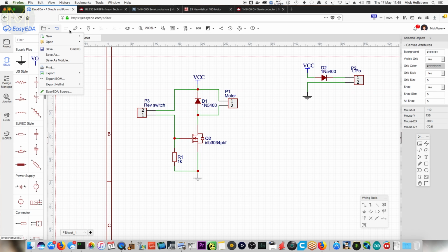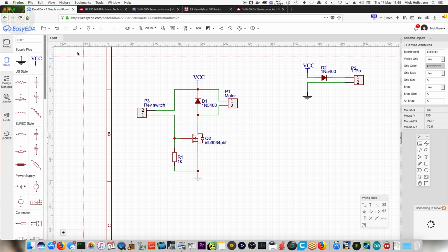So this is per motor, right? Well, you could potentially use it for 2 motors. I only asked because the reason why it's important is where the PCB is physically going to sit. If it's going to be, say, on the handle on the back, then if you're going to do 2 motors, you need to run twice as many leads to the rev switch. The rev motors, the flywheel motors. And those wires tend to be quite thick, high current wires. And there's limited space to run wires past that little channel from the motors back to the main body of the blaster. Right. These are all standard package types.